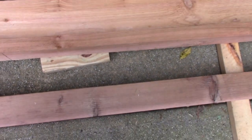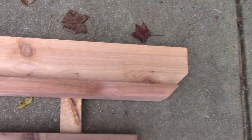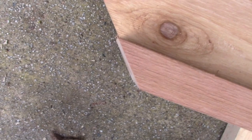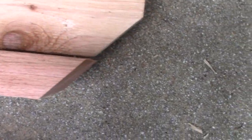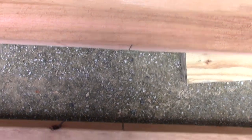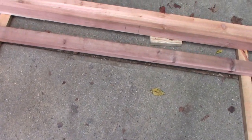At this point the pieces are kind of rough cut, but you can see the shape of the torii gate top taking shape here. These ends will need to be sanded down a little bit — you can see they're not even. That's okay though, because they'll sand down nice and smooth and rounded, and it should come out right when all is said and done. I've got the center position marked off for the little center post here. Overall it's starting to take shape and kind of look like a torii gate.